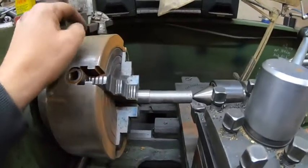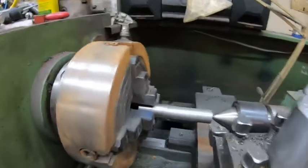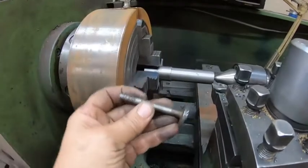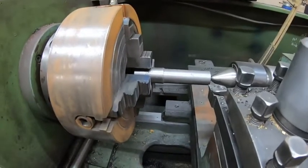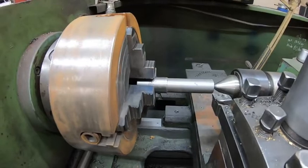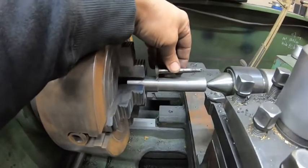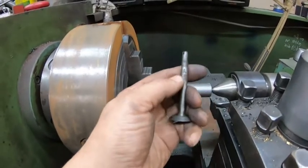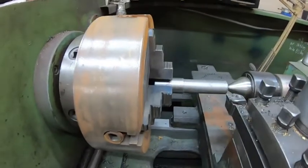You can see I've got my 4140 — a piece of steel we'll use for making a valve. I've got it all dialed up in a four-jaw chuck. I've taken my measurements. It's a little bit bigger than 5/16. I went with a couple thou smaller than the size I reamed out in the head, so that way the valve can move freely without binding or seizing up. Now we'll start — I'm just going to cut up to right here because this is going to be my biggest diameter. I'm going to turn this down to make my valve stem, which is a little bit bigger than 5/16.